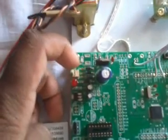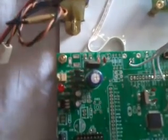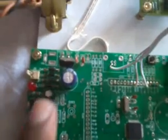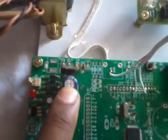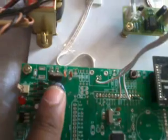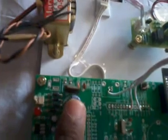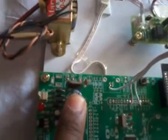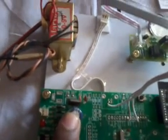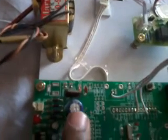diodes. The main purpose of these diodes is that the AC we give is converted into pulsating DC. It's not pure DC. So here we are taking a 1000 microfarad, 25 volts electrolytic capacitor. This capacitor blocks the DC and passes the AC. The main purpose is to eliminate the ripples. The bridge rectifier gives a fluctuating DC, so we have to remove those AC ripples. This is the filtering capacitor.